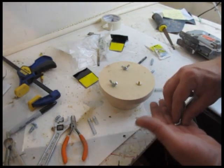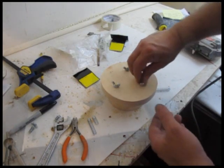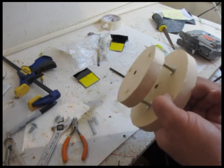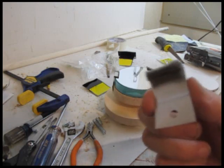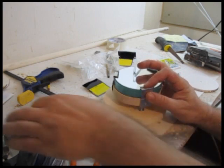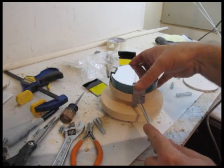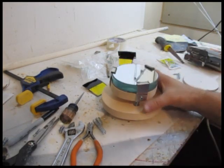To finish this part of the mount, I put washers and wing nuts. The wing nuts allow you to just tighten and adjust them — we can adjust any one of those bolts and change the orientation of the mirror while it's in the telescope. That's important. Now let's put the mirror on it. I made three clamps with a little bit of foam on them to protect the mirror so it doesn't get scratched. Just clamp that mirror down to that top wooden disc. I drilled some pilot holes and screwed it right down. That mirror assembly is done — it's not that hard.